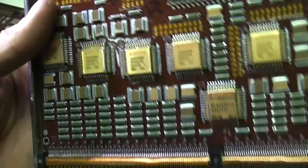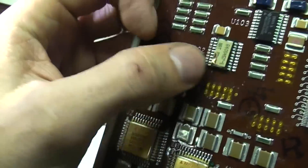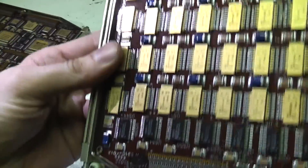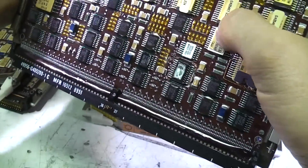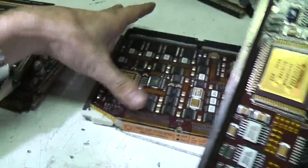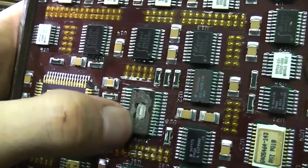There's quite a lot of chips with labels on them. Some of them are probably either Bipolar PROMs or Programmable Logic devices. There are also some UV erasable ones — some Cypress UV erasable PLDs. I've got one with the lid off and the label taken off — that's a UV erasable Programmable Logic device.